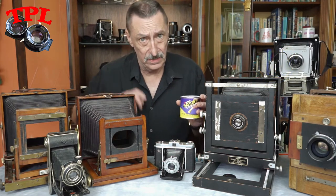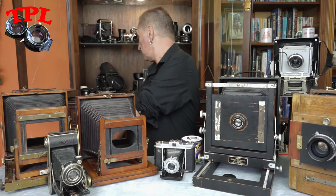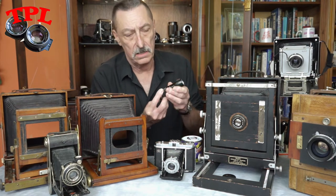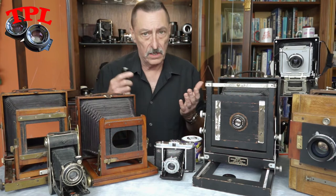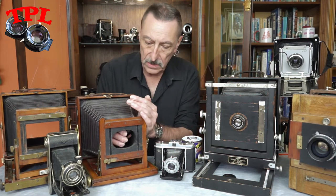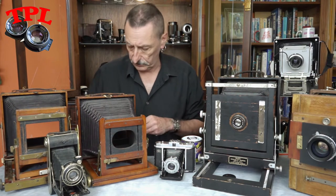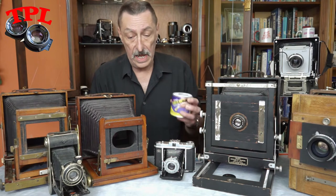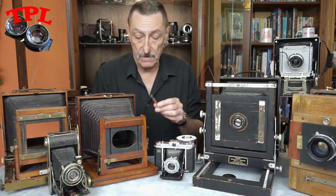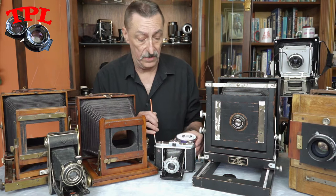I used it on the inside of the bellows and put several coats on the pinholes. Now, identifying the pinholes was done with a very bright LED torch. You can use a light bulb. I didn't have anything available to do that. I simply put the LED torch inside the bellows in a darkened room and shone it down, and it's the corners where they tend to go more than anything else. I identified the holes, left the torch running in, and then took a brush and some Plasti Dip and just painted over the hole till it disappeared. And that's actually really quite effective, and it will last for a very long time.